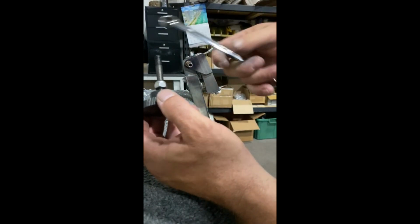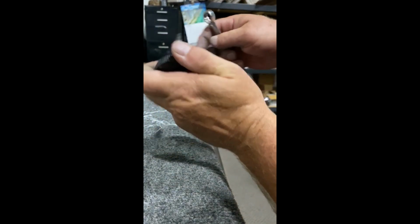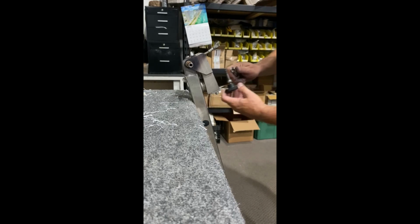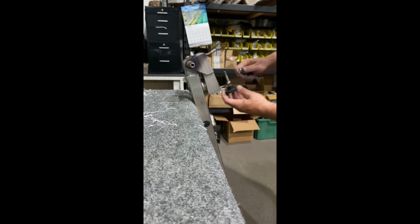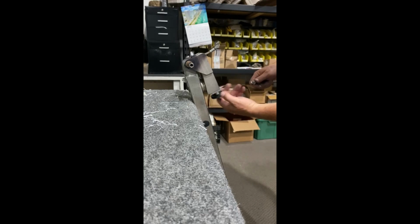I basically take my 1/2-inch wrench and I turn it just a hair. Sometimes I have to turn it more. And when I'm putting it in between the steel here, see, I can still turn it. So I'm going to tighten it a little bit more. Now, if I over tighten it, watch, it'll walk itself out. Well, that won't even go in, but if I was to over tighten it, it would walk itself out. See it walking a little bit there? Once I get it exactly correct, it just spins. So I'm going to finish putting this together.